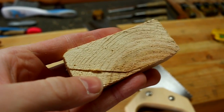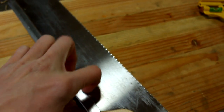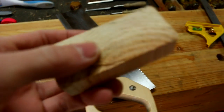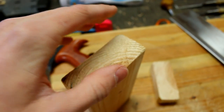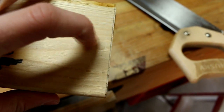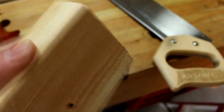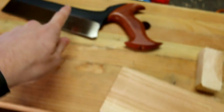This part is where I had to flip the board over and cut from the other side, because it bottomed out and I didn't want to run into the bench. You can see I stayed just away from the line — just a little bit. Right towards the end I like to lighten up just a little bit so it doesn't tear out. I actually consider myself pretty handy with the hand saw. I've used it plenty of times and I think I can get a pretty good cut freehand.